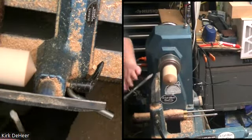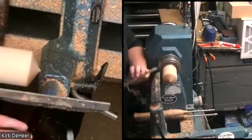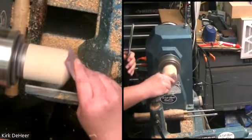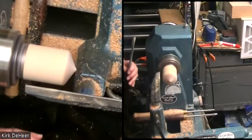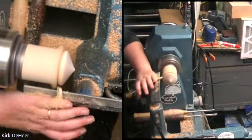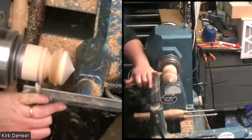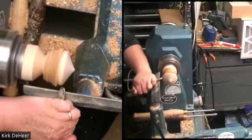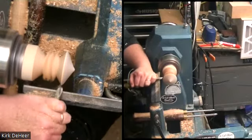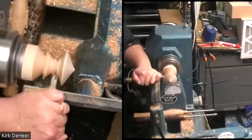I'm going to show you on this next top how to add some texture — I have the Wagner texture tool. We're just going to clean that up just a little bit. Again, we don't want a super sharp point so we'll just sand that around. The trick to this top, just like the other one, we're going to roll and round that bead over and remove material. This one we're not going to remove all the material to start with because we want there to be some support left for the top as we're using the texture tool.